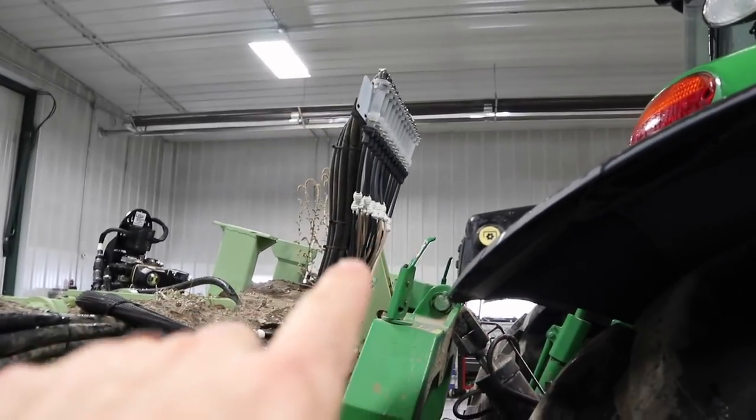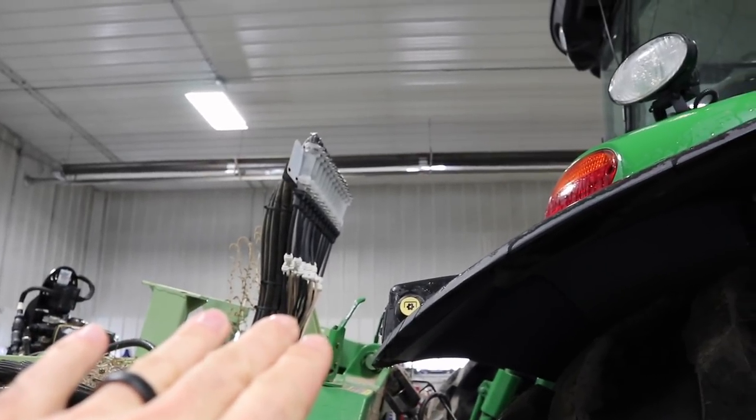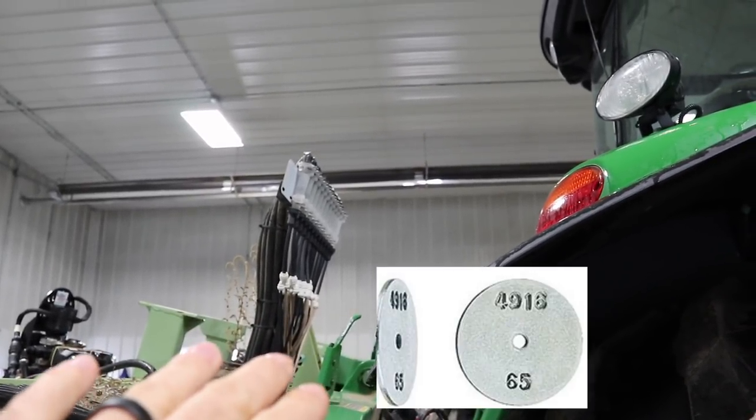What this will do is there are two sets of orifices on this machine. Instead of the old silver discs, Surefire has orifice tubes — different diameter tubes, but they're about eight feet long. That also helps because sometimes you'll get debris in your lines. Instead of having a small single spot where it can collect like in a disc, the hole can be bigger over a longer spread being an eight-foot hose, which allows that debris to pass through more easily. It takes a lot more to plug it.